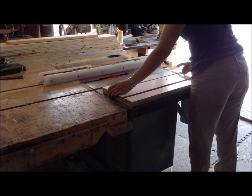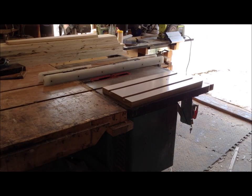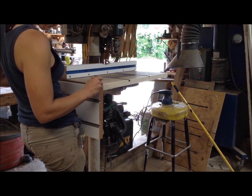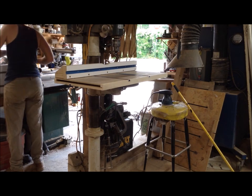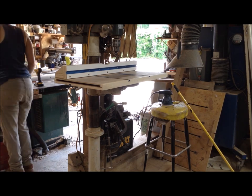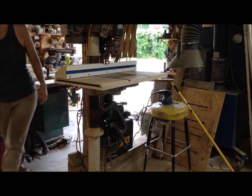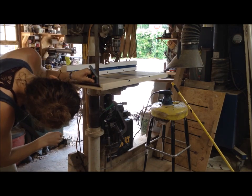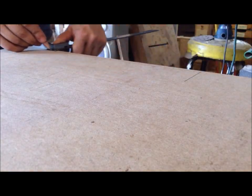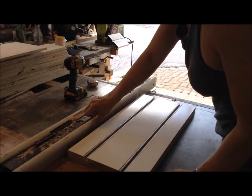The track was 48 inches and I took it from my crosscut sled — I just cut it in half and screwed it in place. I made marks on the vertical fence where the opening is to add the tenon. To get the proper depth on the back side of the vertical jig for the dado that receives the tenon, I used the depth gauge on my square to mark the thickness of the top, transferred that to the back side, then measured down to the bottom of the opening and transferred that mark as well, giving me a perfectly aligned slot.